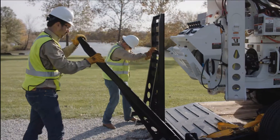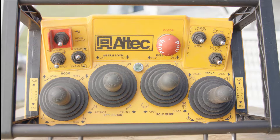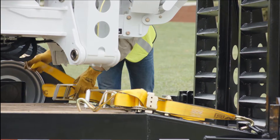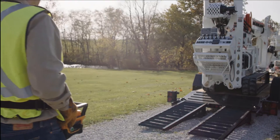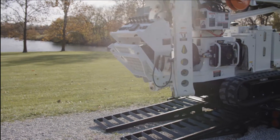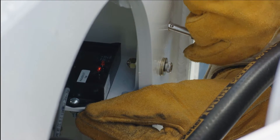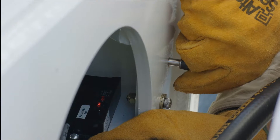Before removing the unit from the trailer, verify the track 2-speed switch is in the off position if driving the unit from the pendant controls, or the track digger shift is in low if driving the unit from the radio controls. Prepare the unit for unloading by removing the straps that secure the unit to the trailer. Unload the unit from the trailer using the slowest engine RPM practical. The trailer must remain hitched to the tow vehicle while unloading or loading the unit. Check visual and audible safety devices for proper operation. Locate the tilt sensor pin on the front curbside corner of the pedestal. Press the ball lock release button on the pin handle and remove the pin. Allow the tilt sensor and bracket to rotate down until the tilt alarm sounds. Re-level the tilt sensor by aligning the holes in the bracket and on the pedestal and reinsert the pin.